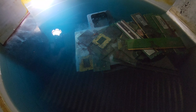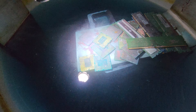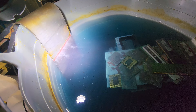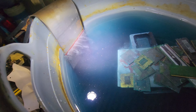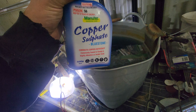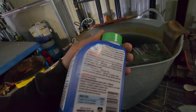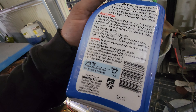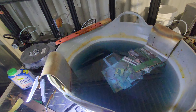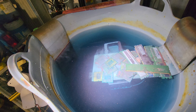We're running it high mainly for this video to show how well it removes material, but with your voltage down low you'll get a lot nicer plating — you can plate your copper over here really nicely. This is a copper sulfate bath I've had going for a while. It's garden copper sulfate solution I got from Bunnings, a hardware store here in Australia. It says 25% copper sulfate and sulfur 12 — it was really cheap, like 16 dollars.